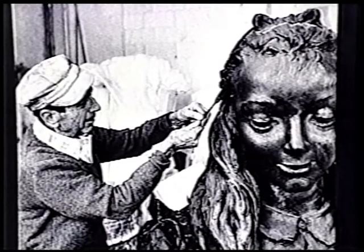The reason for this is when they go into the next process, when the wax is melted out, they pour the bronze in the cavity. That's Jose working with hot tools, right on it, it melts, and he can shape and refreshen it.